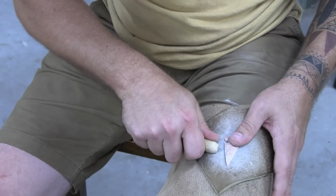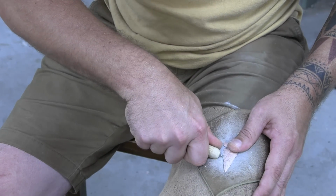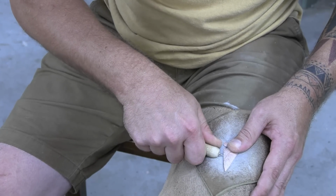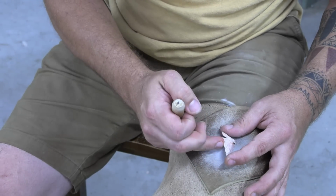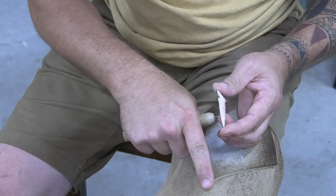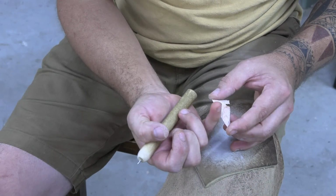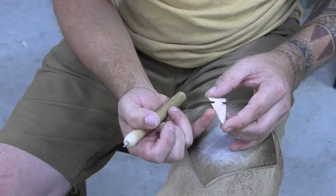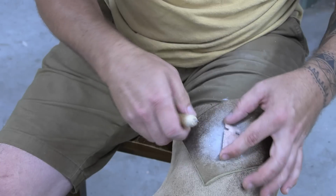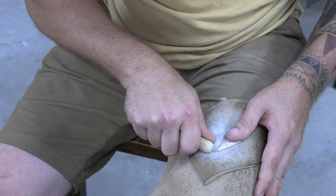And then when I'm coming from this side, I'm grabbing and I'm typically hooking back. I don't know if you can see those slight differences that I make, and the reason is because, again, I'm trying to create that clean break on the leading edge. Having the serration sharp going this way doesn't really do me a whole lot of good. I want the serration sharp going this way, so when I'm cutting, it's grabbing, and the leading edges of each one of those serrations, those are what I'm really looking to be sharp. So that's kind of my technique on sharpening. Check that video out.